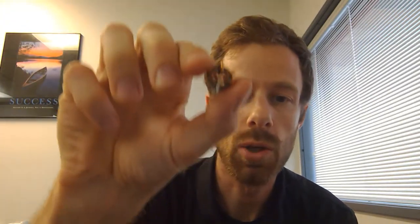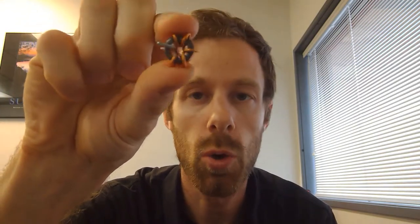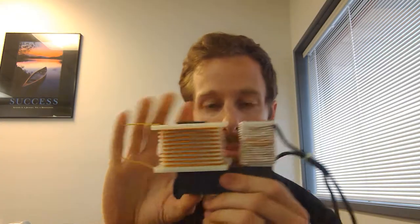Sometimes you'll see the core itself being in a circle — this is what they call a toroid ring. You'll see those commonly on big audio amplifiers, really heavy ones. Most of that weight actually comes from a giant ring of ferrous metal with wire wrapped around it. Sometimes inductors are almost indistinguishable from capacitors — they look pretty similar — but if you hold them in your hand, you'll usually feel that the inductor is a lot heavier because of that metal core. Inductors also show up in one of the most common components for power transmission: the transformer.